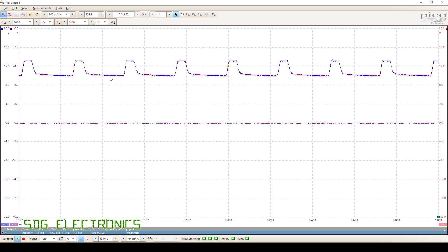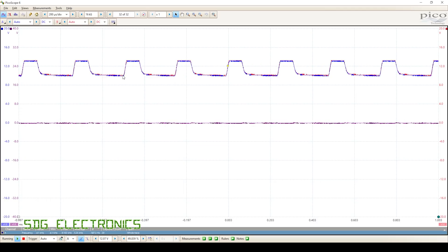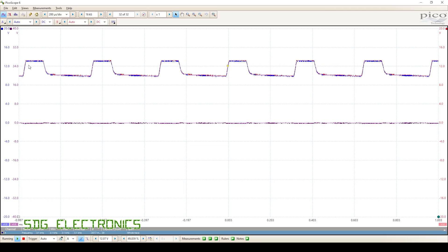What we can see is the waveform out to the LED — this is the node on the side of the inductor that is in contact with the LED. This is the point where the LED is on, then the LED is off, and this is our PWM dimming waveform. If I change the brightness you can see the mark-space ratio changing. If I change the frequency of the PWM waveform you can see that reflected in the waveform. So what this output capacitor is actually doing is not trying to smooth out the PWM dimming waveform — it's reducing the ripple during the on time of the LED, at the switching frequency which is 300 kilohertz on this board, 125 kilohertz on the original design. What we're actually hearing is not an effect at the frequency where we're trying to operate the capacitor — it's at this PWM frequency where we're seeing a large change in voltage as the LED is turned on and off.